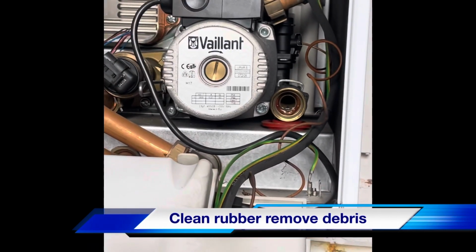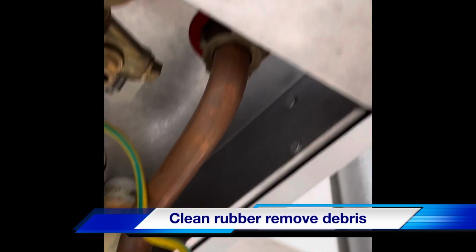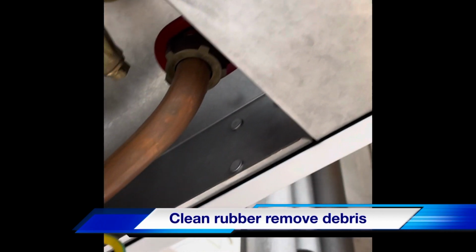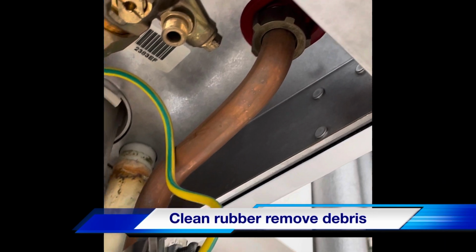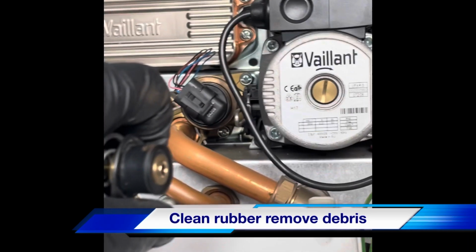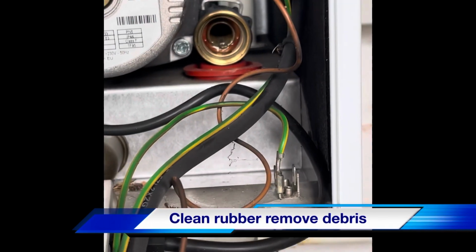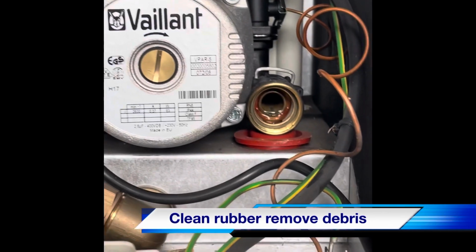We'll pressurise the boiler. We'll disconnect it underneath there so we can see if there's any drips or anything passing out of the pressure release valve. I find a very good success rate with this, just cleaning the PRVs, cleaning the inside and putting them back together. It can get you out of trouble if you haven't got the part on the van as well.